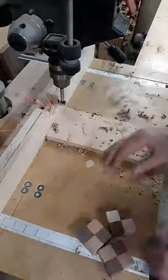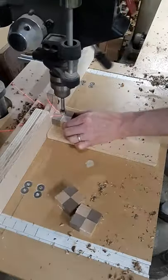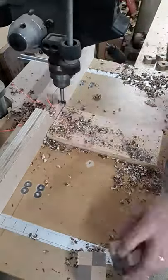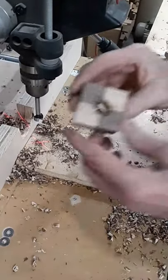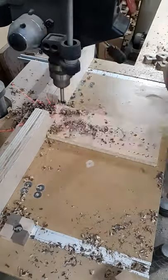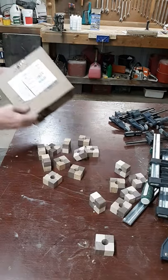Then I drilled a 1-inch hole in the center of each block. Originally, I intended to have a corded light inside the torch, but later changed my mind. And as usual, something goes wrong in woodworking. Here, the Forstner bit grabbed the piece and tore the center out a little bit. Luckily, I'd cut enough extra blanks and it didn't matter. I just set this one aside.